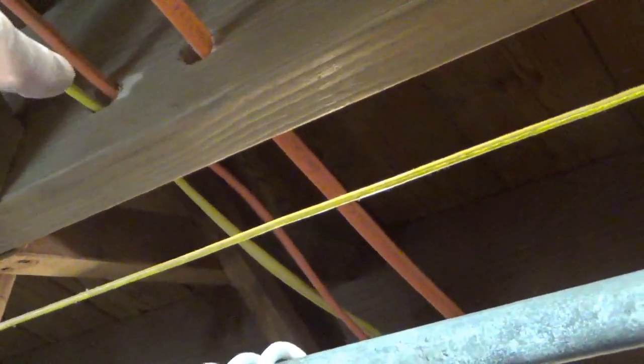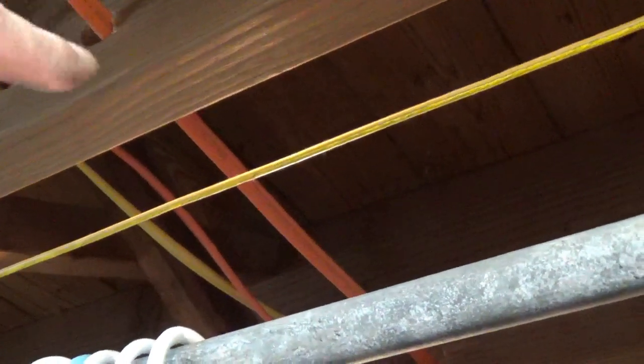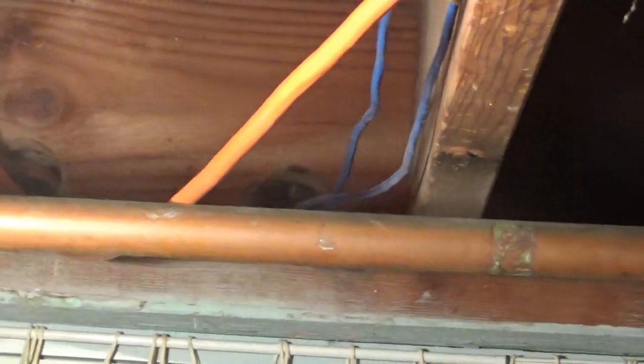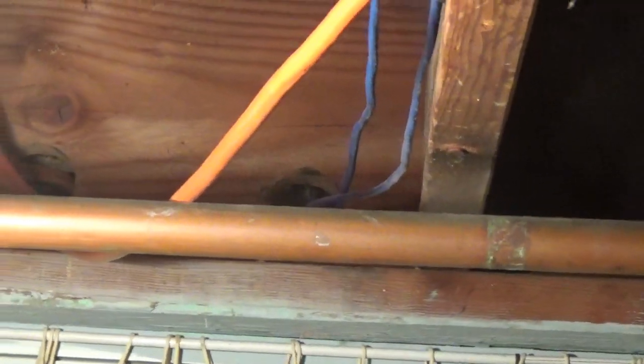So that's going to be my 30 amp welding outlet. I'm going to run a 12 gauge 20 amp circuit for the workshop. So I didn't have to drill any holes. I enjoyed that little bit of forethought before to drill some extra big holes, and we just went right along here. We had done 3-inch holes, we'll see it from the other side. Yeah, 2 3-inch holes. It has to go through the end joist, and it goes through brick, which we had to chisel out, and then 2 other joists in the new section of the house.